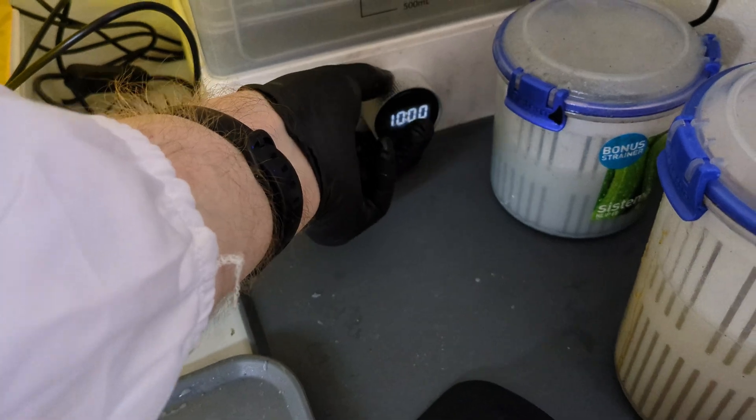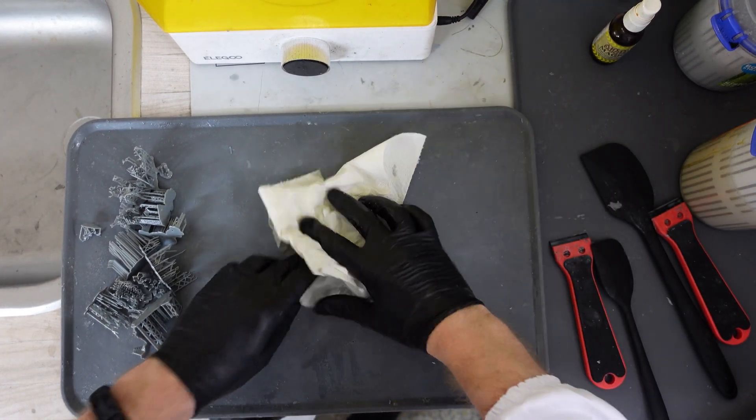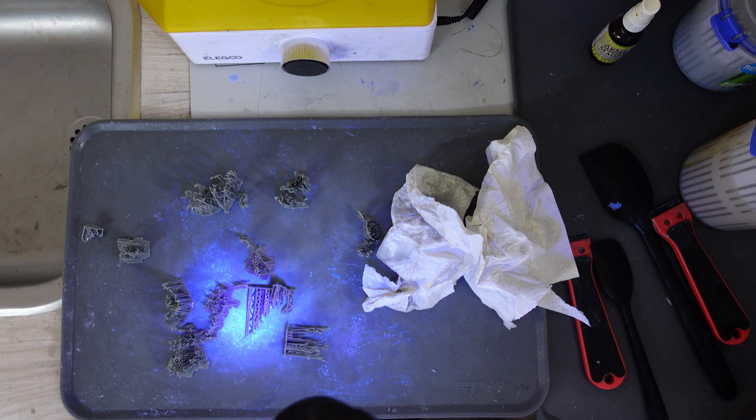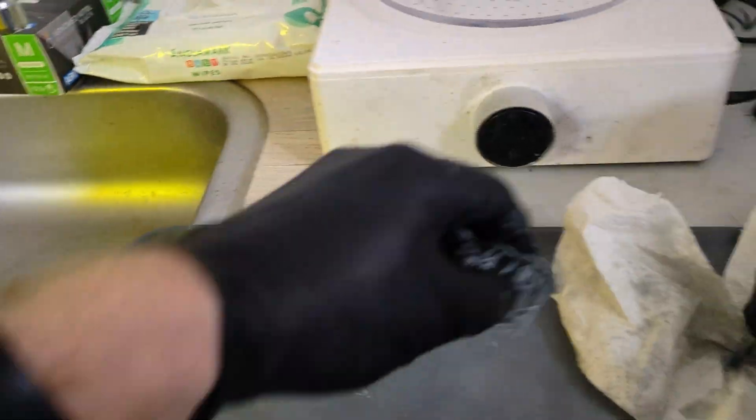I hit about 10 minutes on the wash station and let it run. While I'm standing there with my resin protective gear on, I use those 10 minutes to clean up. I take some paper towels and wipe any spills on my tray, then put on my UV-protective glasses and hit everything with my UV fast-cure light. All of the supports I put in my curing chamber and give them a good 15 to 20 minute spin. In the end, all of this resin waste goes into a clear plastic bag in my bin, and once that's full I'll hang it in sunlight for some days to cure.